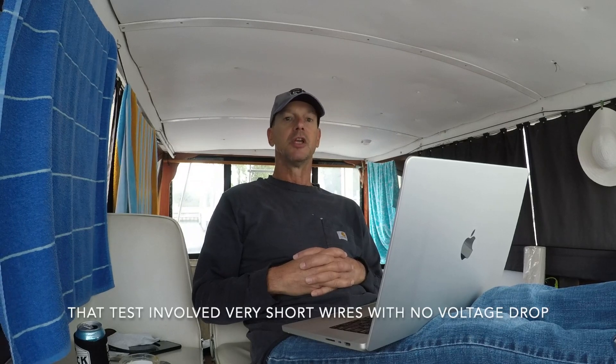I also tried putting the Trina panels in series, but the voltage was too high and the Anker would not take the charge either. So those Trina solar panels are fine used, but they're just not a good match for this Anker. What I really want are solar panels that are at least 40 volts, all the way up to nearly 60, so I can pull in twice as much power through that solar charge controller.